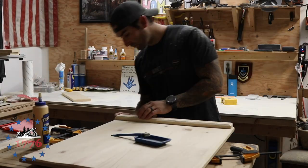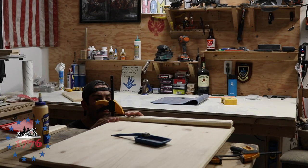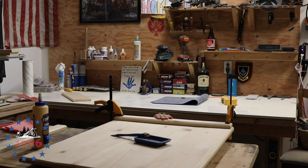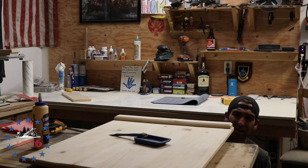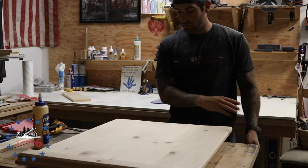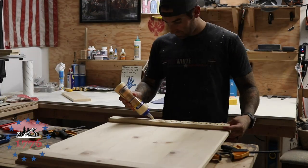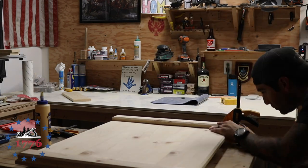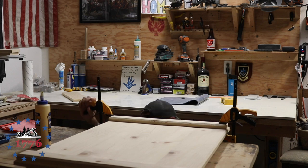These are just the runners — I'm gluing them in and then Brad nailing from the bottom to keep it plenty tight. There were a couple places where there was a little bit of a gap that I was nervous about, so I ended up clamping it down, putting a brad nail or two in, and then leaving it until the glue had dried.